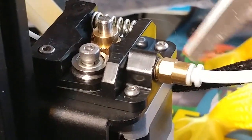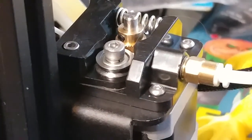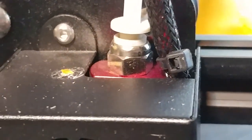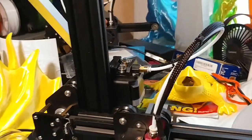Make sure this is fully seated. Don't over tighten it. Make sure these tube ends are fully seated. Make sure these grub screws are aligned with the flat. None of this should be loose. This spring should have a lot of tension on it — it should be a good squish when you press that. See how it's fully seated in there? The coupler is fully inserted. Make sure the tube is fully inserted, and make sure your nozzle is nice and clean. I suspect it's this right here — something loose here, something not right here — and that's what's causing your issue.